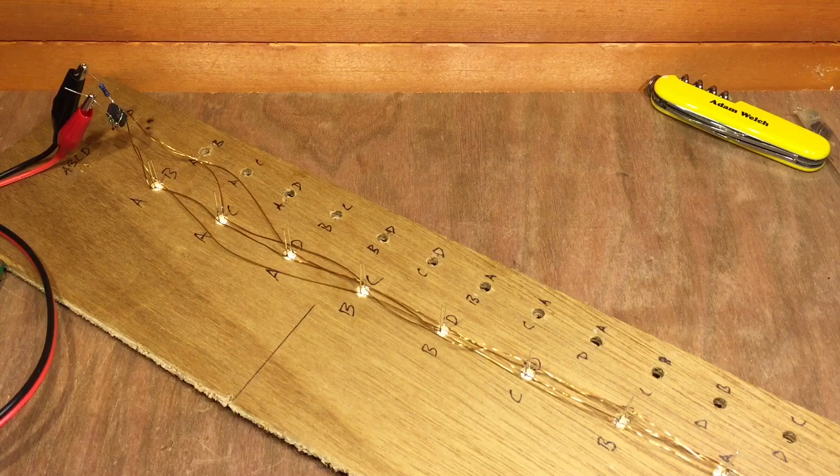This is a meteorite, and it's the meteorite that BigClive.com has published a video about. It's based on his code using a PIC microcontroller — the 12F629 if memory serves — and it uses tri-state multiplexing to light 12 LEDs.